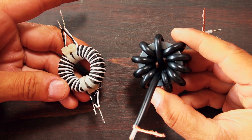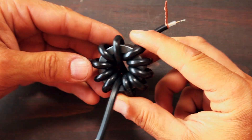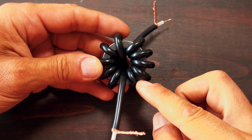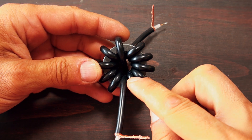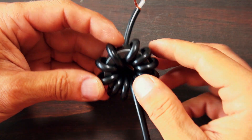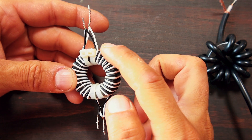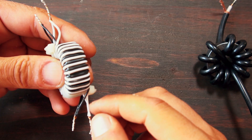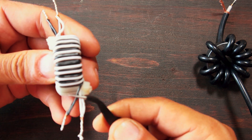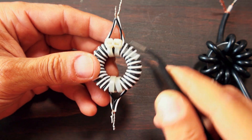Let's get inside and have a closer look at these two different RF chokes. Here we are inside with both RF chokes prepared for measurement. I have two different versions — the version with the coax cable, which is basically five turns of coax cable on one side, then the sixth turn goes through the coax cable and comes back around, five more turns, and comes out on this side. Over here I have 12 turns on one side and 12 turns on the other side, using a pair of wires — a black one and a white one for each side.